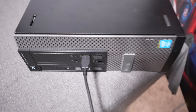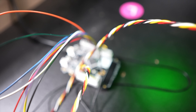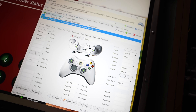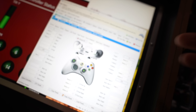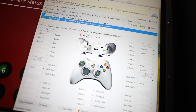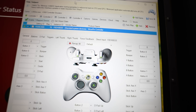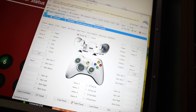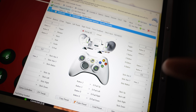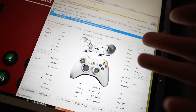The board connects to the computer via USB. Let me show you how it talks to the computer and how button configuration works. Previously we used Joy to Key with the cheap zero delay encoder; now with this encoder we're going to use x360ce — basically an Xbox 360 controller emulator — which interprets all our button commands as if we were playing FX3 with an Xbox controller.